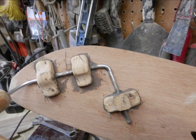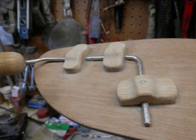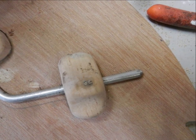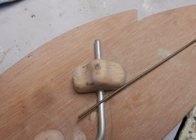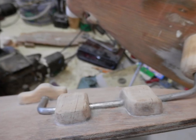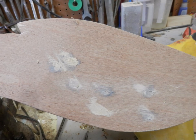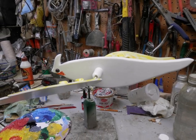Here you can see I attached those little clamps to the wings with some JB Weld, and now I got it all cleaned up. That groove that the rod fits in I left a little big, and I filled up the gap with the JB Weld. You can also see a little hole in the top — I drilled a 1/16-inch hole through the rod and put a piece of 1/16-inch brass rod through there just to keep it from moving.